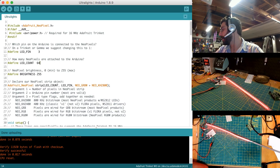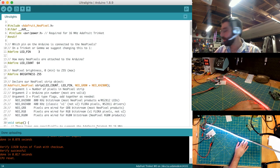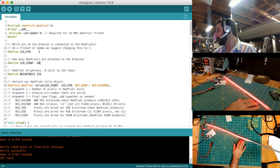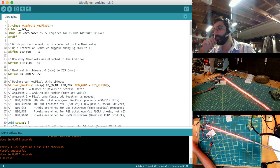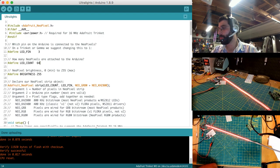So this would be the number of LEDs used. It's not even a minimum scenario; I guess a minimum scenario would just be 16 LEDs. But this would be wrapping 4 sides of 2 crossbars, which I think you'd be visible from every angle, no problem. And this is ridiculously bright. And it looks like the power consumption is never even hitting 0.4 amps, which I think is more than reasonable.